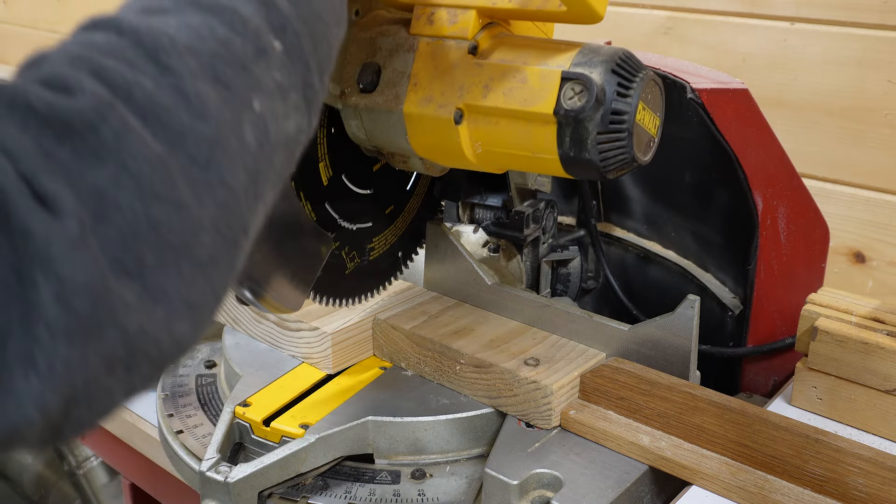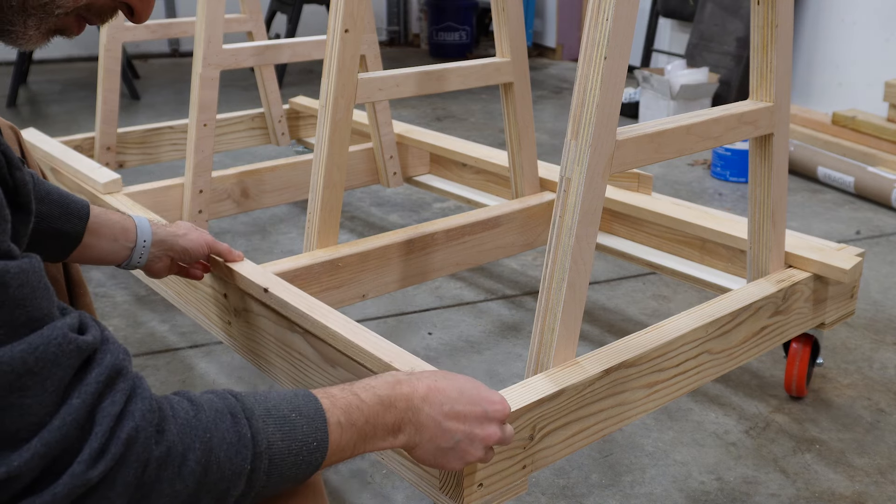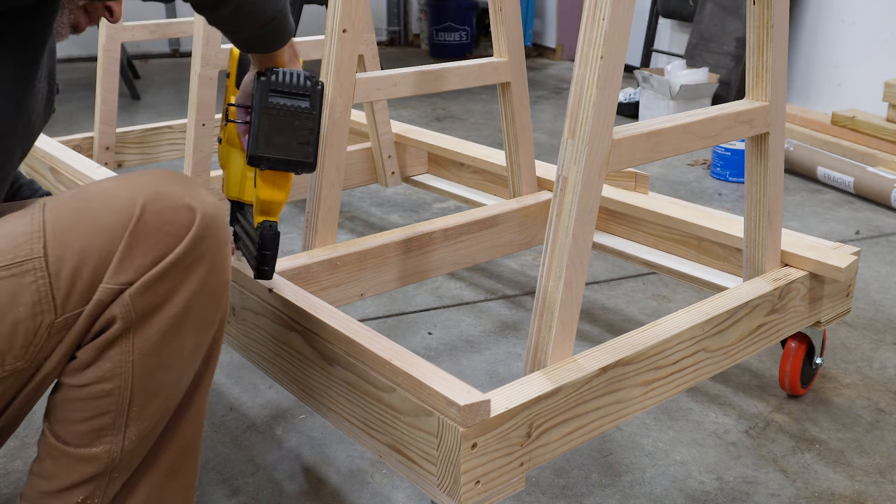To achieve this, we'll cut a few 10-degree wedges at the miter saw. We'll also rip a 2x4 with a 10-degree bevel and glue it along the side edge to further support the shelf.